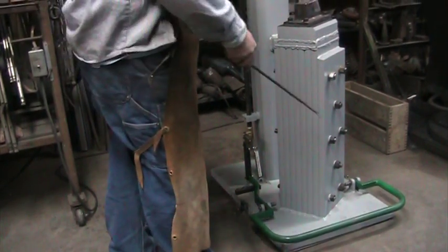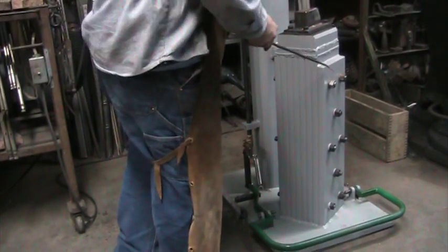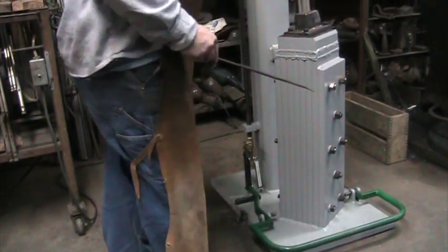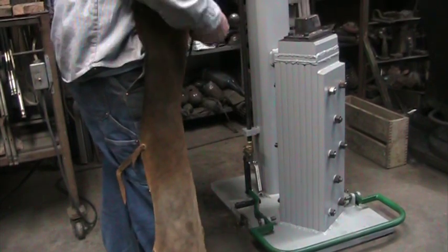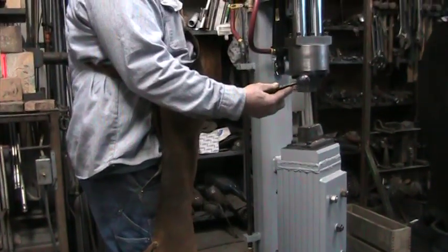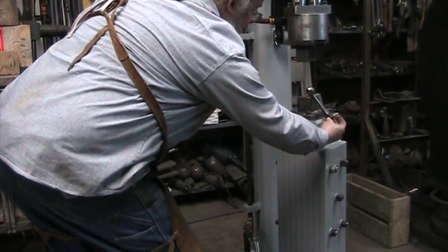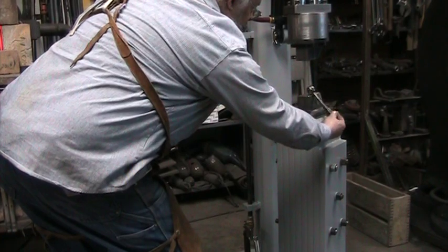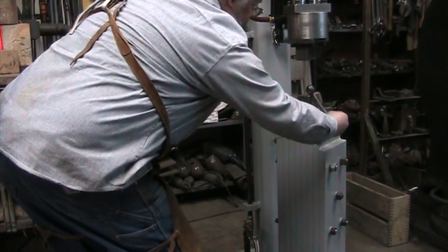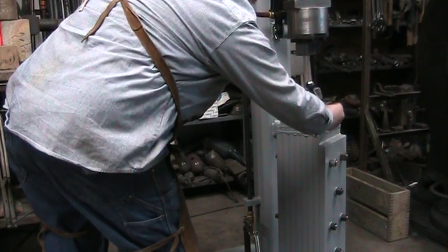You'll notice that this very front piece has been abbreviated a small amount. That is so that we can have a close presentation to the anvil when making stuff like faceted balls. You need to be able to get right up close like that in order to make your ball, and by cutting this piece down we've got a real nice angle here.